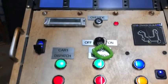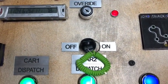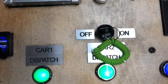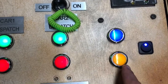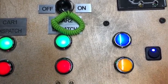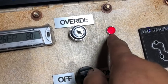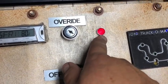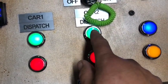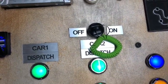Powered up. The other thing I actually installed on this — since I have them running remote controls, on-off switches, RF switches for the ride vehicles — I actually have this as the spiel, the safety speech, hooked up to a prop controller. But I hooked up an override right here, which actually lights up this light to tell me it's engaged. Once this is engaged, it actually cuts the power to the remote controls. So that way, if there's a problem, you can actually turn the override on, take the key with you, and go help whoever's having a problem.